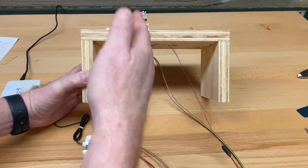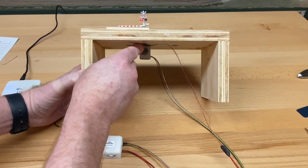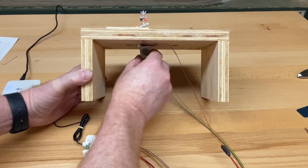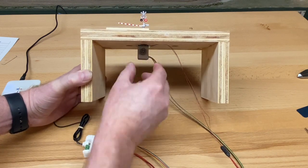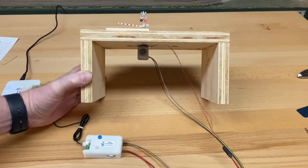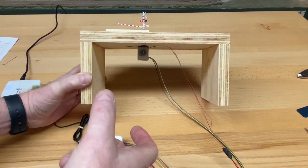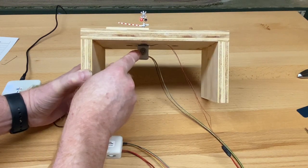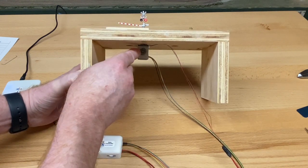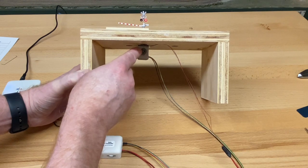If we were to use one of the other holes, we would get more than 5 millimeters of travel, which means that if we started the hole at the top dead center and ran it down, the motor would push off or something like that. So what you have to do is adjust both the top and the bottom so that you get exactly the 5 millimeter movement using another hole. So it's still going to be 5 millimeters going up and down. You're just using a different hole and a different amount of rotation to accomplish that.